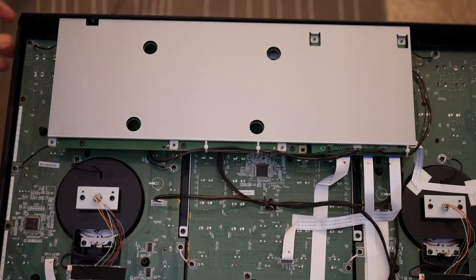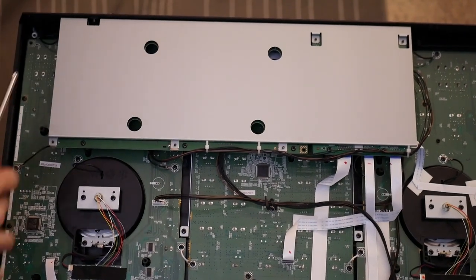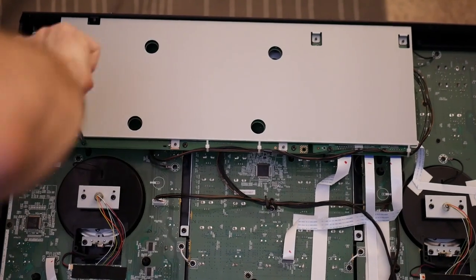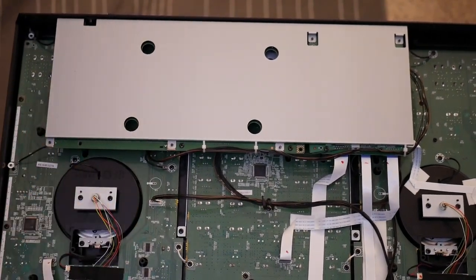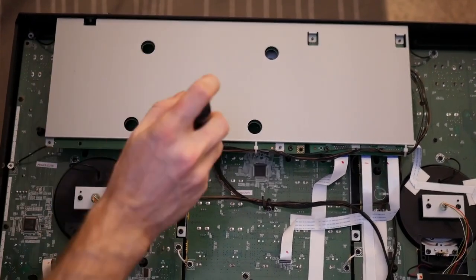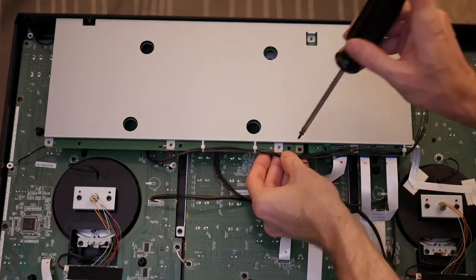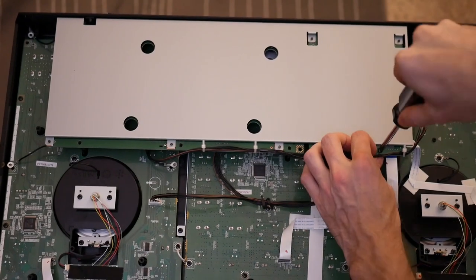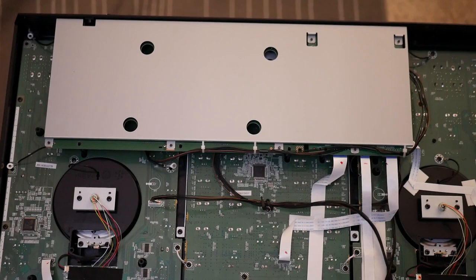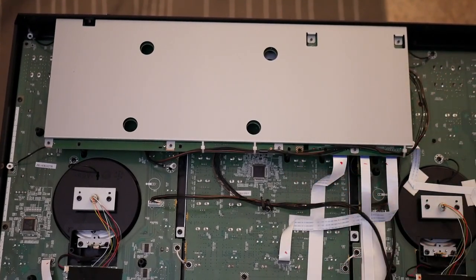Once inside, start by removing the ground straps around the I/O board. We can also start removing the screws on the edge of the I/O board. Take special care when working around the wires bundled at the edge of the I/O board — these can generally just be moved out of the way as you unscrew. Continue to remove any ground straps from the lower boards as you work your way around the I/O board, just leaving the last one for last.